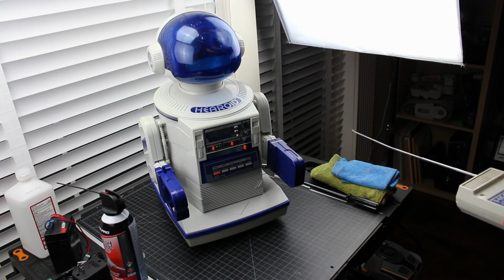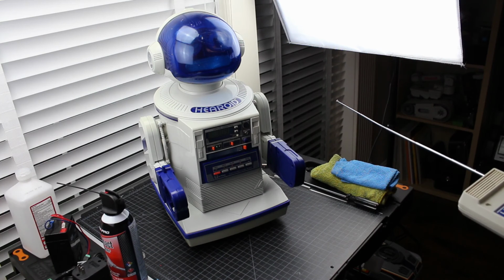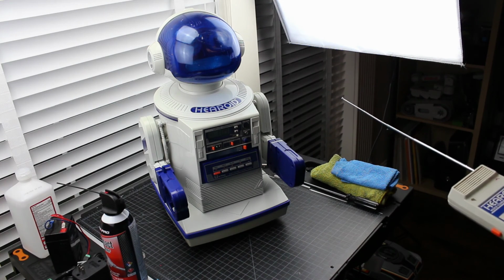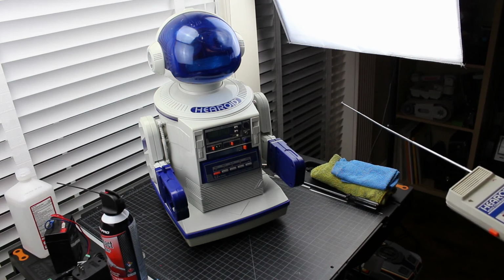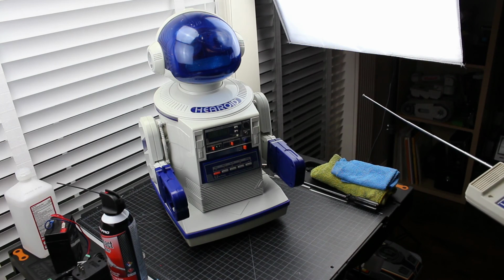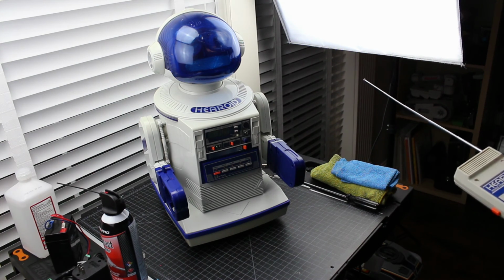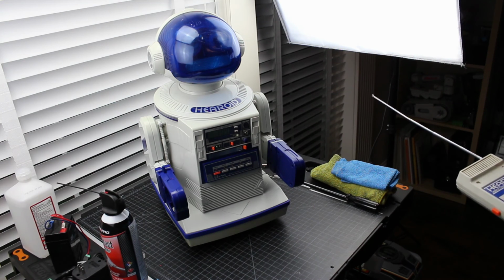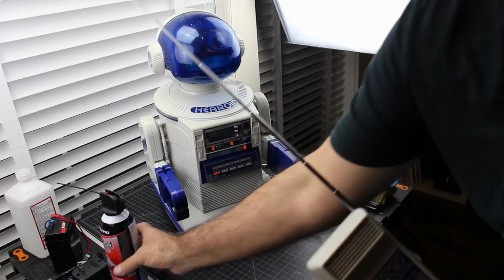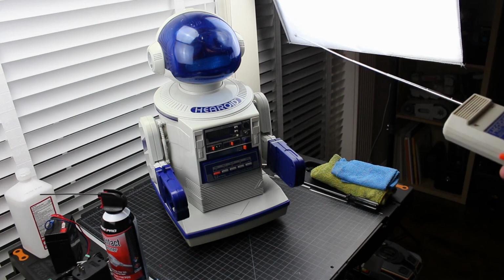Don't ever think a motor is completely wasted or dead. If you run into the same problem, clean it first. In the worst case scenario, open it up and clean it, and then put it back together again, because I bet you money if you open it up, you're going to see that the copper in there is black, and that just needs to be cleaned. I'll use vinegar to clean it sometimes, or you can use WD-40, but you saw me use this electrical contact cleaner to get this thing working.